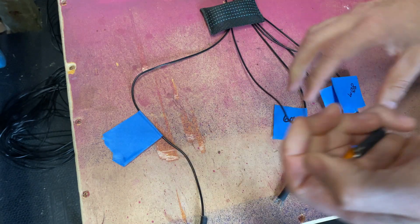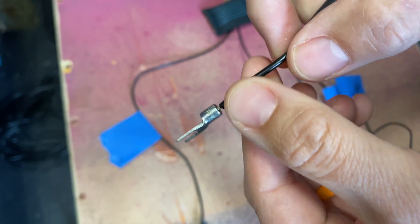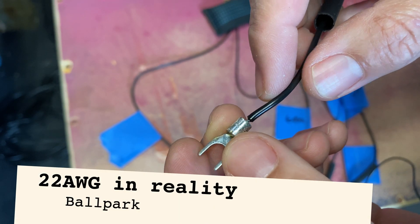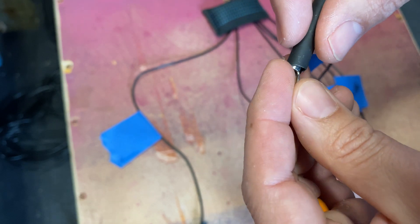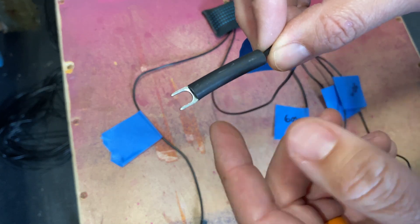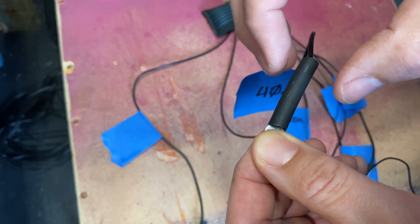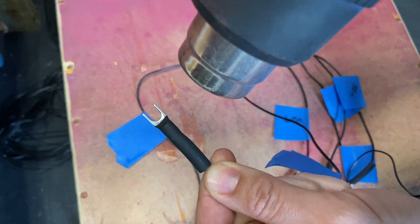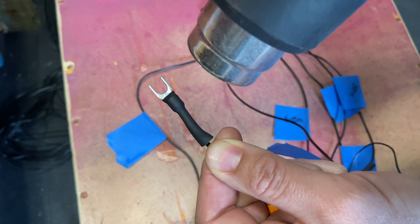The solder joint there isn't much on there, and this is a 12-to-10 gauge connector with 18 gauge wire, so there's a big gap in the step and I'm afraid it's going to become an issue over time. So I'm going to heat shrink it with the adhesive-lined stuff first, then add a couple more layers from my kit — at least one or two more — to build this up with more strain relief. You can see how it pulled back; I'm holding it with my thumb to keep it from sliding, and now it's shrinking to the point where my thumb is no longer in contact with it.